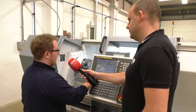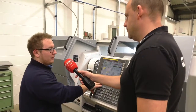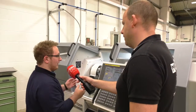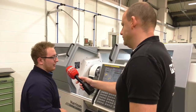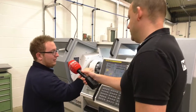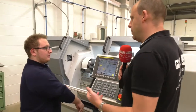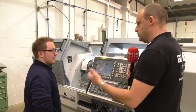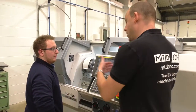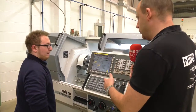It's straightforward, but when you go into automatic mode, health and safety requires the doors to be shut for anything using an automatic system — so when that canned cycle runs, doors have to be shut. But essentially you could look at it like two machines: you can get a job in, turn a diameter and face a part manually with doors open, or if you want to go into full CNC mode, you can do that too.